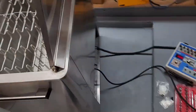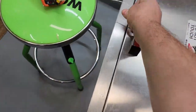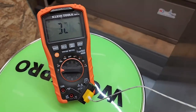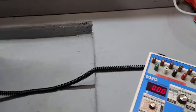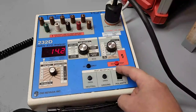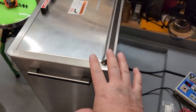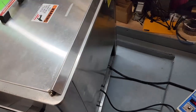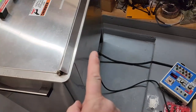So, here's where it gets interesting. It has not been heating up too quickly, which, you know, that happens. It's maybe a little cold in here. Let's go ahead and set that guy back. Okay, it's at 102, not too bad. So the power switch was fried, which was an indicator that it's pulling too many amps. So I kicked it over on this guy, and I just hit the on, and I'm sitting at 14. Now, mind you, I just told you that it should be pulling about 12.5. There's no motors on here, so the heating element should be maximum current draw. And I did ohm it out, and it seemed to have been correct. But if it's pulling more amps than what the ohms of the heating element say, there's probably leakage.